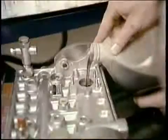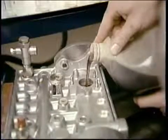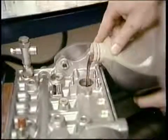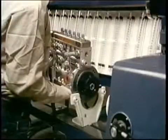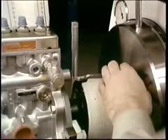Be sure that you have the latest test specifications and written instructions. See that your pump has enough lubricating oil. Diesel fuel may act as a lubricant, but it won't keep your pump going. You know basic test bench procedures — how to mount the pump-governor combination, how to align the coupling horizontally before you tighten the jaws.